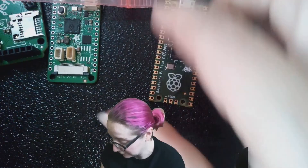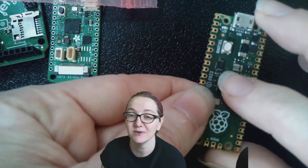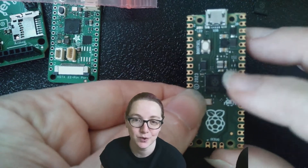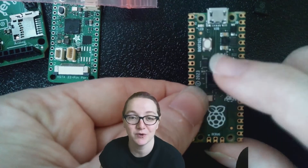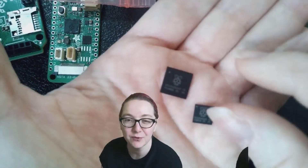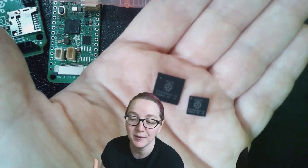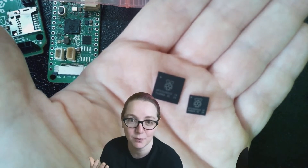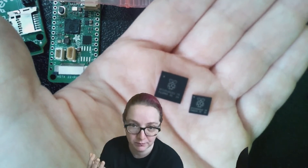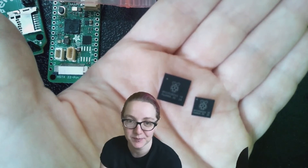You still need to use an external flash chip, but what's nice about the Pico 2 is it now comes with four megabytes of flash, not two megabytes, which is great because with all that extra processor speed you're going to want more space to store your program. The Cortex-M33 runs around 150 to 160 megahertz, but from our basic bench testing for CircuitPython it's about twice as fast — just the processor being a much more modern processor with the M33, the floating point unit, and the optimizations.